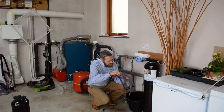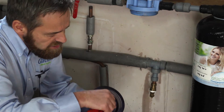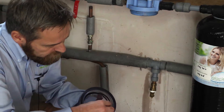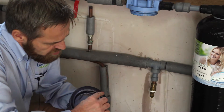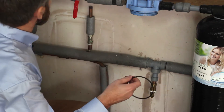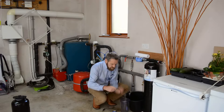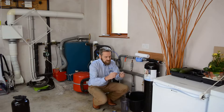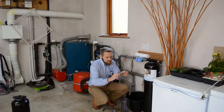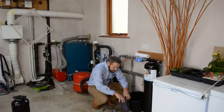If you were to just screw this back on with the filter in it, it may leak. So the best thing to do is take a blunt screwdriver — inside there's a rubber o-ring which you just remove. Get some vaseline, just an ordinary little tin of vaseline, and simply grease around the edge of the o-ring. Be quite liberal with it, and insert it back into the groove on the top of the pre-filter.